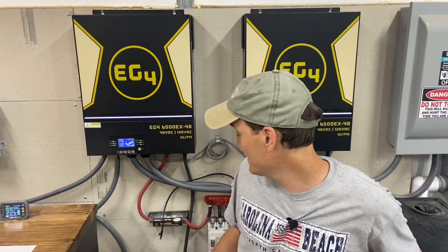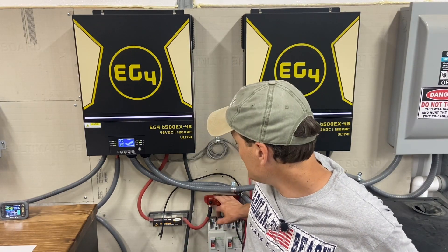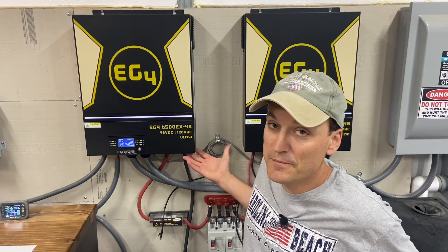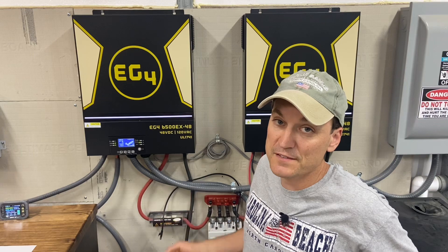As your voltage lowers, you're going to be a little higher in amperage, but that's why I have, up until this point, been using the Current Connected bus bars. They are sized with some headroom for this system. There is a surge capacity on these, but it's only one second — so you're not talking about a very long surge — but as long as you give the bus bars a little headroom, they'll be able to take that.